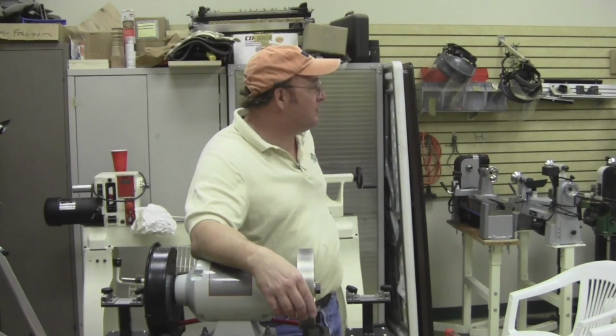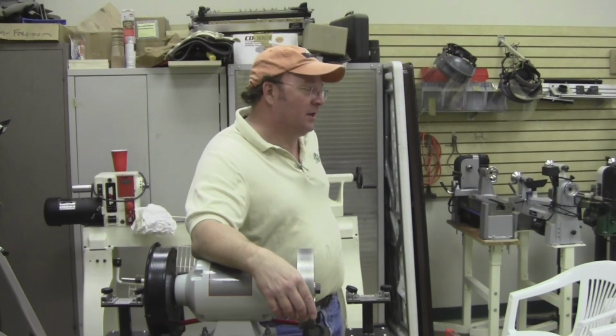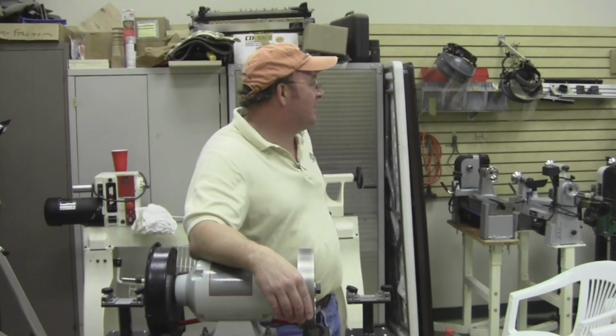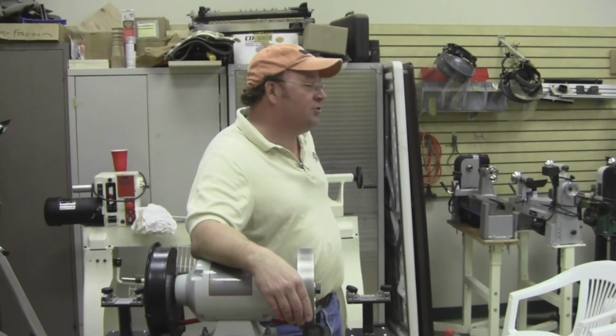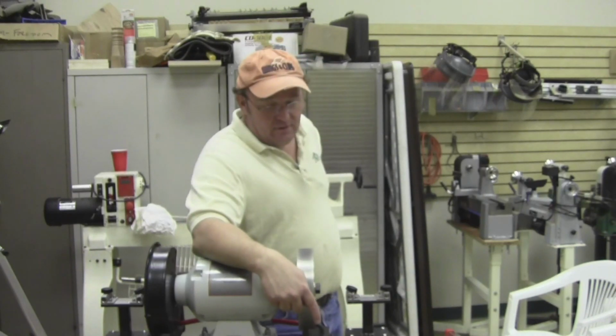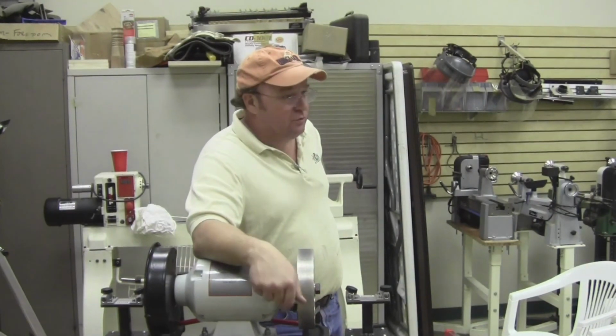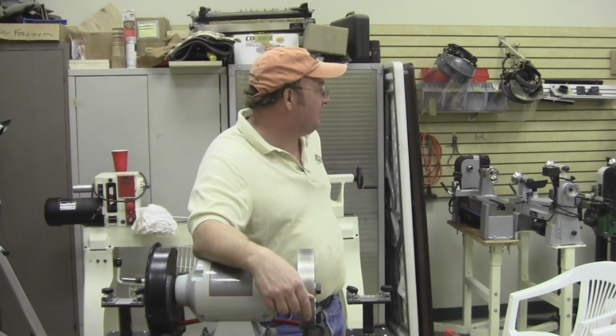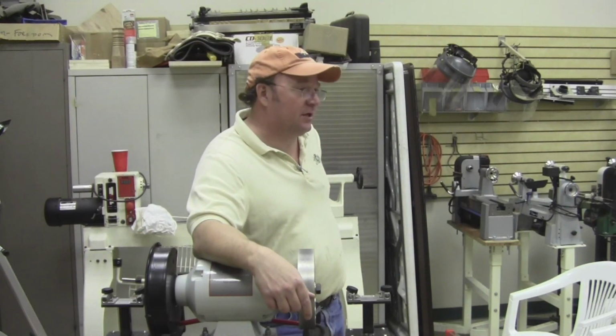That's what a lot of people don't realize, that a lot of times the way we use a gouge is exactly like a skew, and you're paranoid about using a skew, but yet you'll use a gouge the same way. When I use the wing, I'll rub the bevel and use the wing of a gouge just like a skew to take nice fine cuts. It works wonderfully, but that's almost like using it as a skew in a planing cut.